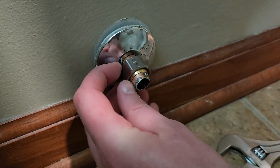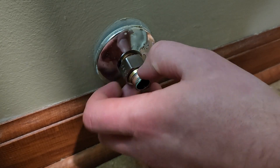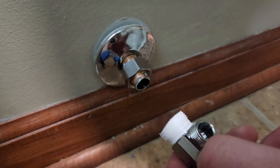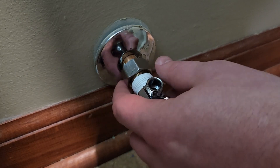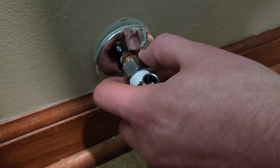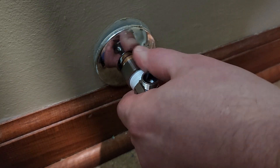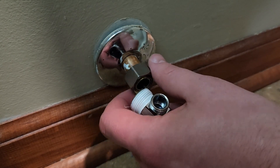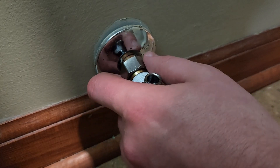I like to try and put that ring roughly where the previous one was. It's kind of a balance here. Put a little bit of plumbing tape on here — I know I've read you're not supposed to, but it's a belt and suspenders kind of thing. I've found they leak occasionally if you don't have that on there. Go ahead and get this hand tight. You'll have to keep in mind where that copper ring is — you don't want to tighten it if the ring is too close to the end of the pipe, so we'll shoot for about where the old one was.